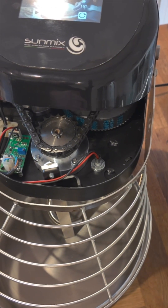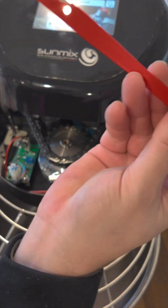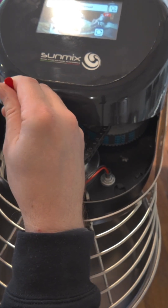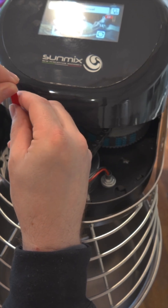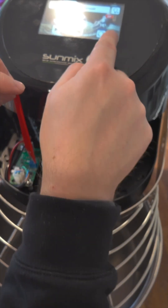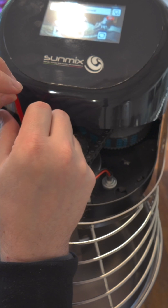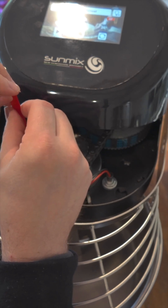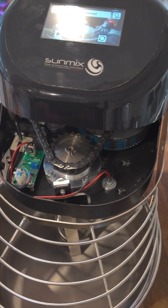So just take your lid off and put the lid somewhere where you can see the temperature reading. I'm using a bread slasher because it needs to be something thin to sit in that slot. If you've got a nice thin flat head screwdriver — I'm just going to twist that. You can see the temperature going up: 19, 20, and we're going to go all the way to 21. Right, 21, and that's it. So that's manually physically calibrated on the board.